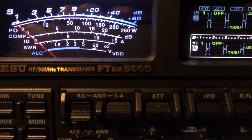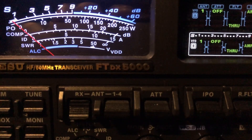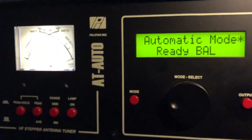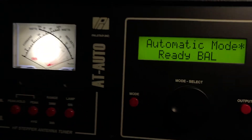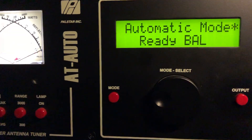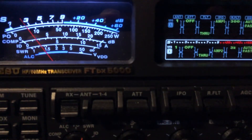This is no fancy antenna — I don't have a beam. I'm using a 160 meter doublet with a tuner. One of the original PALSTAR AT Autos is connected to the antenna via balanced line, and it's only at about 45 feet. But it serves me very well on the 20 meter band.